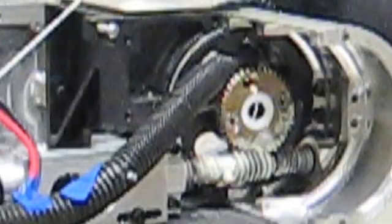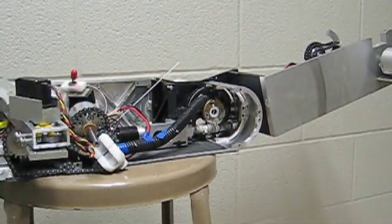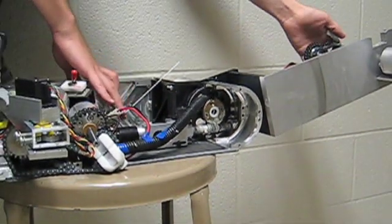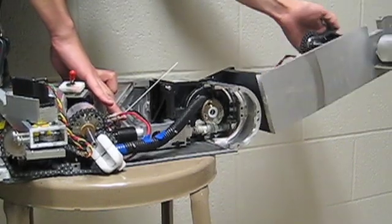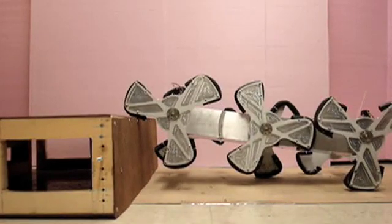When the body joint motor drives the joint actively, a worm and driven gear function in a normal fashion. However, when the front of the body experiences a sudden load, the worm is not back-driven. Instead, the worm slides axially but not radially on its shaft, and it is cushioned on both sides by Belleville Springs. This reverse action is effectively a rack and pinion where the front body segment is the pinion and the worm is a spring-loaded rack.